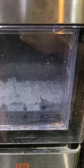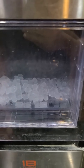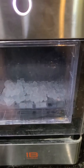That usually means either your condenser fans are clogged up with dust or your compressor is going bad. In the case of this unit, I'm pretty sure it's clogged up with dust.